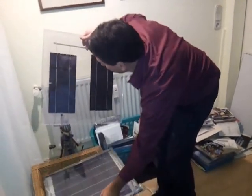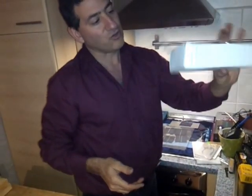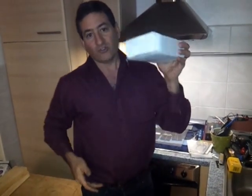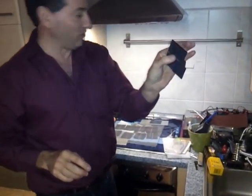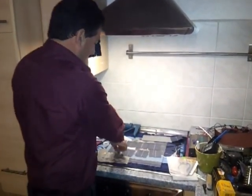This one I made with gaps in it so it could be used as a window and still let light through — building-integrated photovoltaic. The cells themselves come in a box, which you can carry. This carried about 100 watts worth of solar cells that I had in my backpack and took to Nepal, and then you solder them in place. Rather than carrying a bulky panel to Brazil, to the favela, carrying it up the mountain to the village, you simply carry a box of cells and a soldering iron — it can be a butane-powered soldering iron if there's no electricity — and make the panel where you are. It turns out to be a lot cheaper. Now, they do break — they're very fragile — but you can still use the broken pieces. If you can get them cut properly, you can use half cells and make a whole panel out of half cells.